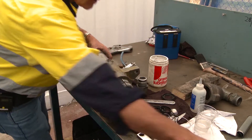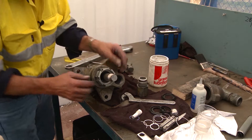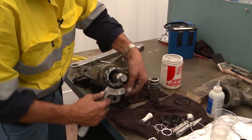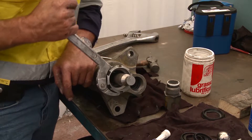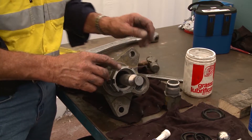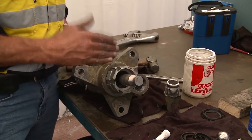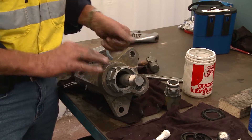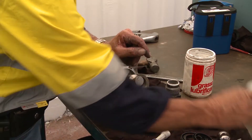Now we've got the piston back in. Be very careful of this ring land — it's top heavy so put a piece of rag underneath so you don't damage the bottom. Now for the tension gland nut: on a new install, nip it up until you feel a fair bit of resistance — that's plenty. Once you've run this for the day, check that tension again with no pressure on the cylinder. Dump the valve to release pressure in the chamber, then you'll be able to pull some torque back on those packings.